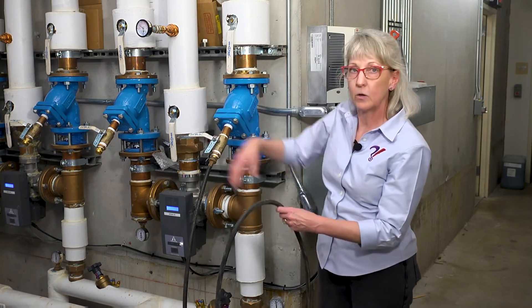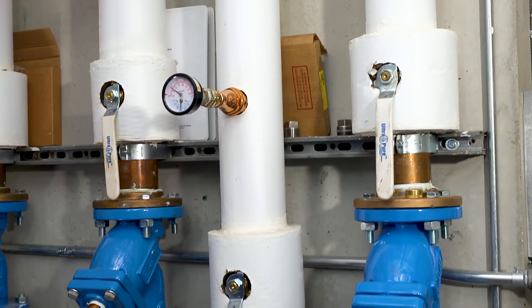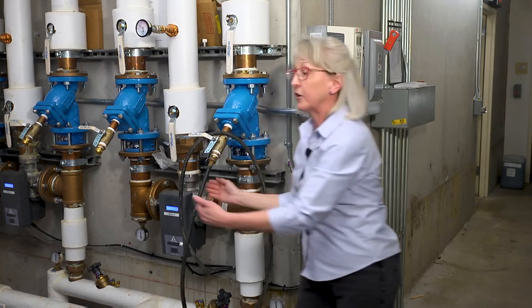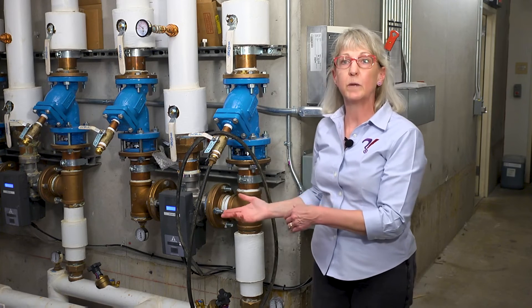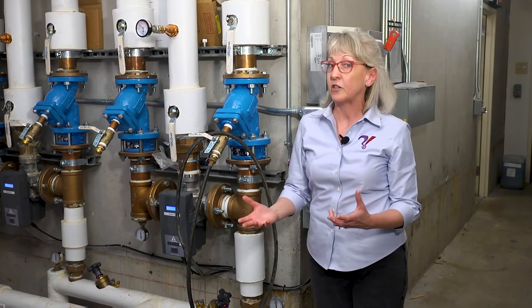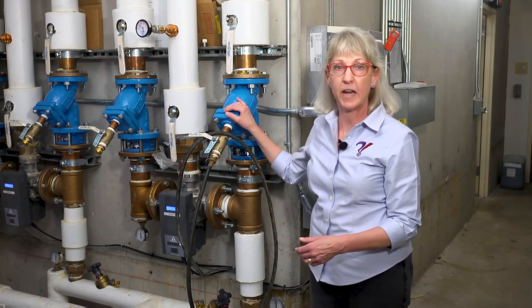Once it's running clear, you can close the valve and you're basically back to a new strainer, and your equipment will remain protected for a while longer. These strainers are upstream of an electronic mixing valve which takes cold domestic water and very hot domestic hot water, combines them together into the perfect temperature water for your fixtures in the building. It's very sensitive equipment, and that's why both the hot and the cold water coming into the mixing valves have strainers. You may also have an old-fashioned mechanical thermostatic mixing valve, and those are just as sensitive to debris, so even they need a strainer on every pipe going into them.